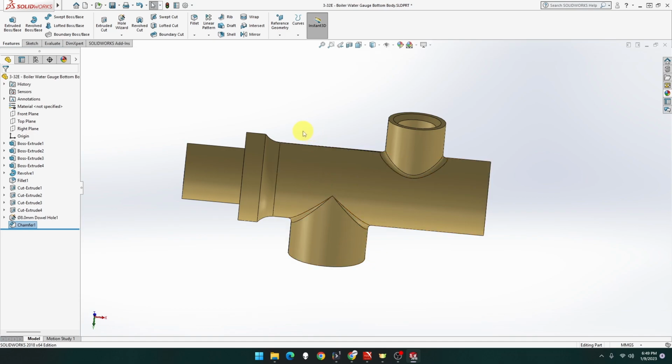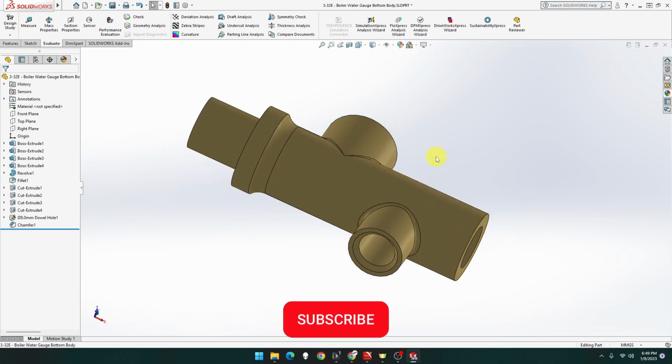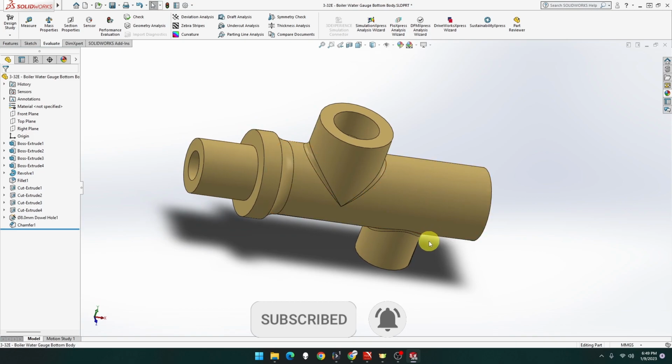Raise 4, that's done. Okay, let's just double check some measurements here. Overall should be 63. So from that point to that point, 63 millimeters, perfect. That's what I just wanted to make sure. So that's 63, so excellent. Oh, it's upside down. That way. Beautiful. Okay. That's part 3-32E, boiler water gauge bottom body, done for the Clayton Undertype steam wagon.